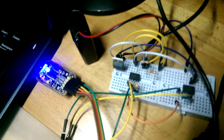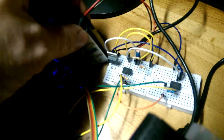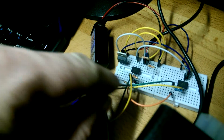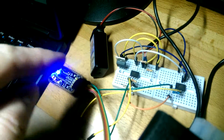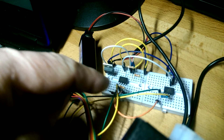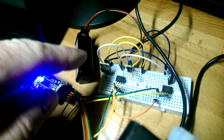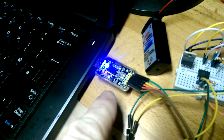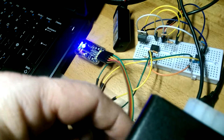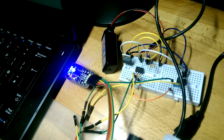Very short little video. USB loopback running with an external 9 volt rechargeable feeding a 5 volt regulator for the isolated side. Very, very isolated. Now there is no electrical connection between the two sides. USB serial port — that's powering the PC side, 5 volts from there.